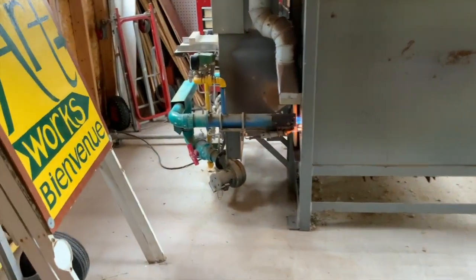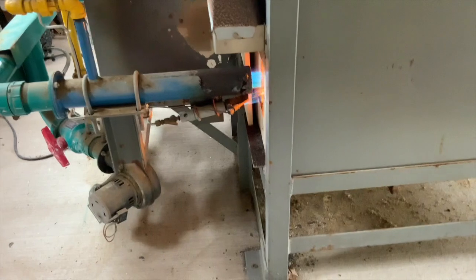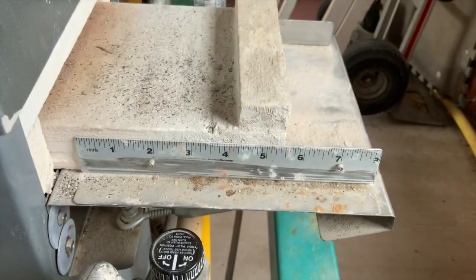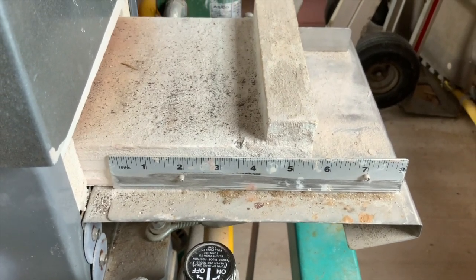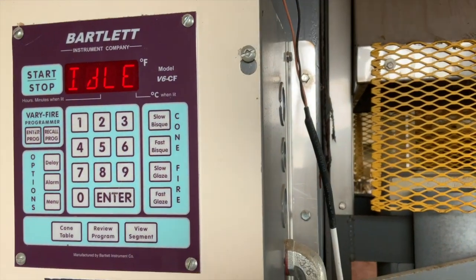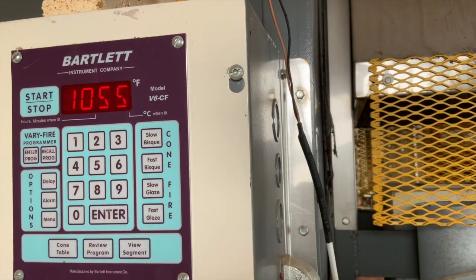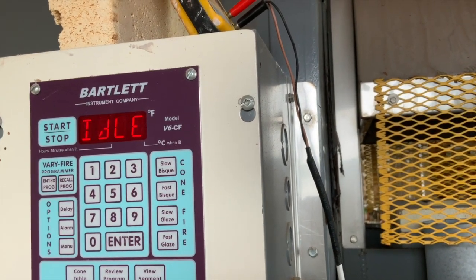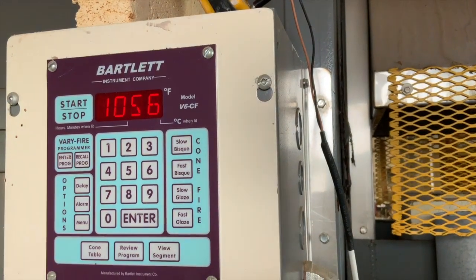It's now 11 o'clock and the kiln has been firing for four hours. I still have it set at zero gas. The gas pressure is still barely there — there must be something but hardly anything. The flame is still a nice oxidation flame and the temperature is 1179°F. All of that was done with almost no gas. Now I'm past what I think of as the dangerous point — the 1000 to 1150°F range, where you get most cracks. I did close the damper down. That's all I needed to do, to get less hot air going up the chimney. I still have it open three inches.